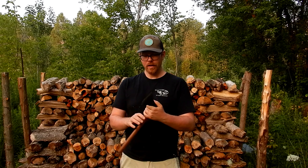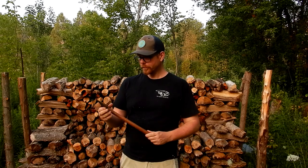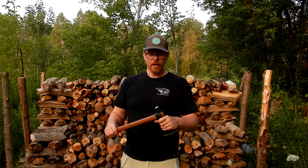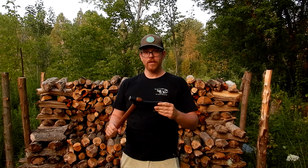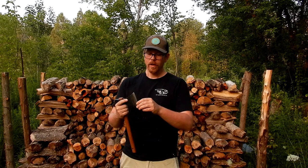The other thing I liked is that the head is heavy — 750 grams — which puts it in range of a lot of bushcrafting or trail maintenance axes, the kind of light utility axes. Another great thing about slip fits is you can have more than one handle and it's easy to swap them out. I would have made a second handle if I hadn't run into the main thing I did not like, and the reason I can't give this a positive review: once I put a carving edge on it, it couldn't hold an edge because the steel was too soft. To me, that's a deal breaker.